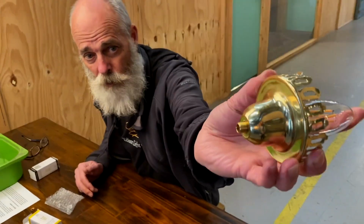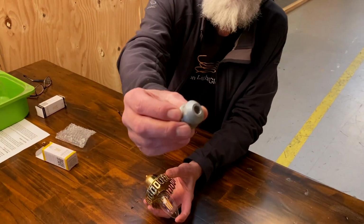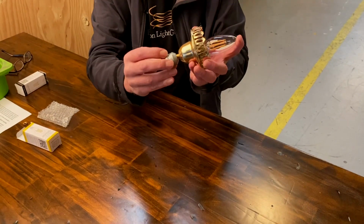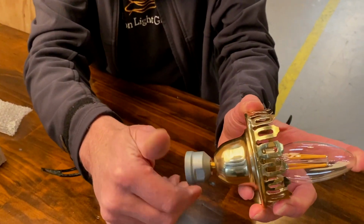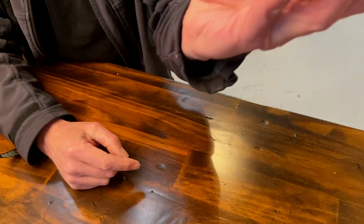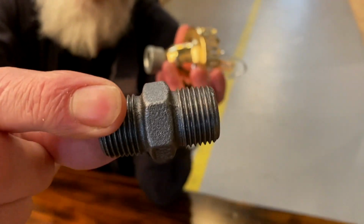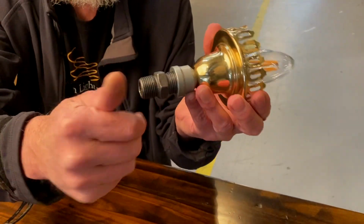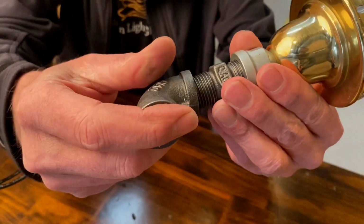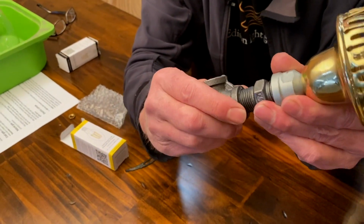So the idea of this was then to manage to fit the gas light into the gallery. So we just put a 10mm threaded entry through, and we will use our 10mm coupler that goes 1/2 inch pipe to 10mm, and you can come in closer. I can screw that on there. That then gives me a 1/2 inch plumbing pipe fitting, and in there I'll put a hex nipple, and then going to add an elbow. There you go.